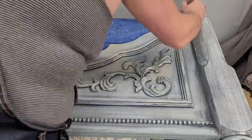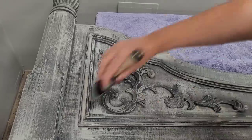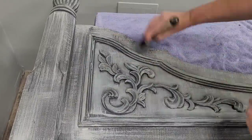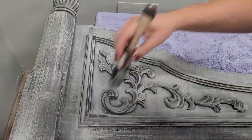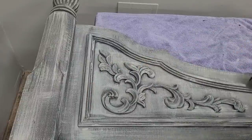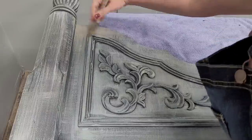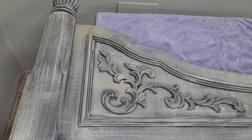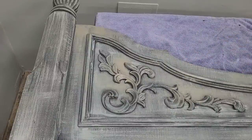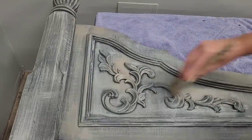Once I had that nice soft color-wash layer of light blue to soften my cross-hatching underneath, I'm also using a little bit of a champagne metallic — this is from Modern Masters — and it creates little gleams of color on the bed frame where it picks up the light and makes it sparkle a little. I really like the contrast of the flat matte chalky paint against that rich metallic. I added it in certain spots kind of at random, though I tried to make it look even across the entire piece, choosing spots where the metallic would really be seen and picking up corners that catch the light prettily. I applied it with a little bit of water so the brush strokes spread and aren't very defined.